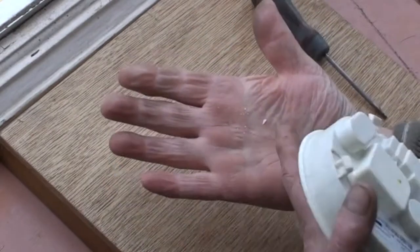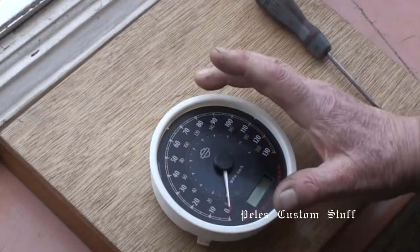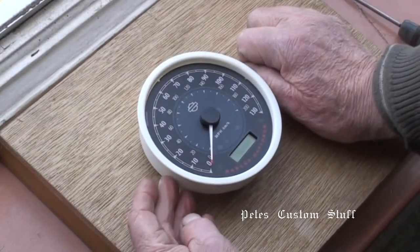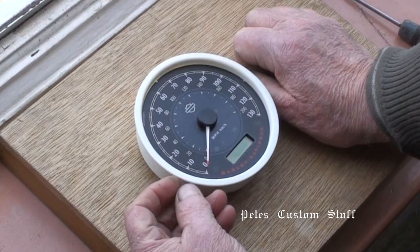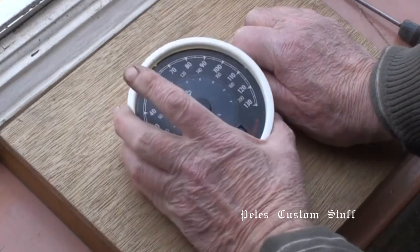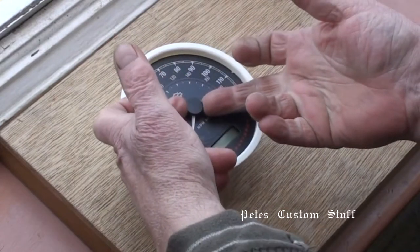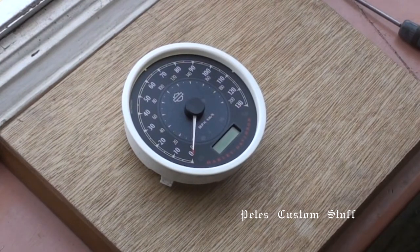This is the type of thing you're faced with — if I get swarf inside and it appears on top of the dial, I'm in trouble. You can't continually bend the bezel because it's only thin brass, and it's already been rolled so it's slightly work hardened. If I undo it and roll it back again more than once, it's going to start cracking. So I think it's got to come apart, but I want to protect the dial behind the needle. I'm playing around with ideas at the moment.